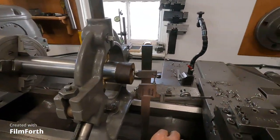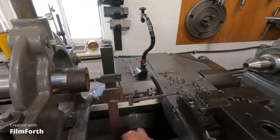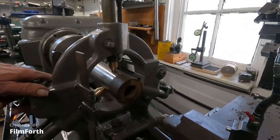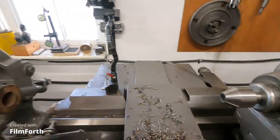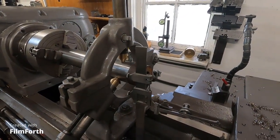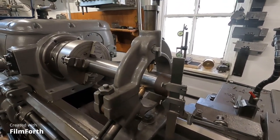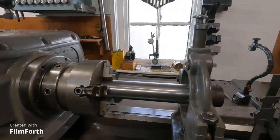Oh, and also old habits of using the 10EE are coming over here. I'm using this height gauge to set my basic tool heights. Okay, so I got the steady rest set up, and I'm going to cut a bevel here for this bull center. Then I'm going to take a couple of finish cuts, like with the 10EE, with a micro 100 half-inch bit with quite a bit of radius on the nose, and see how it does. Check for trueness and things like that.